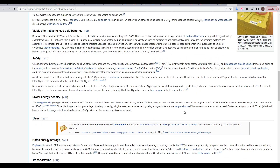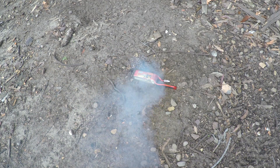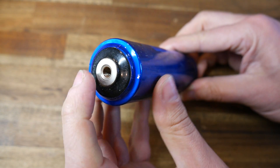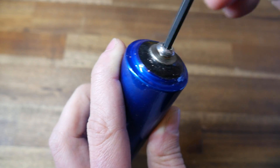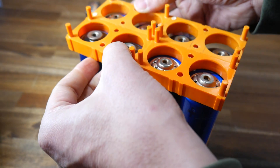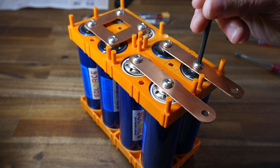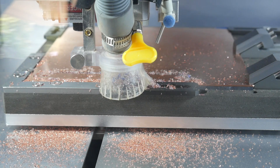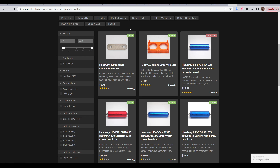Lithium iron phosphate batteries are considered safer than other rechargeable lithium cells, meaning your project is less likely to go up in smoke if something goes wrong. User-friendly — but what really sets them apart are these screw terminals built into each end. They have an M6 thread, which means connecting cells together requires no spot welder for a reliable, strong connection. All you need are some plastic spacers and metal strips with 6-millimeter holes. Off-the-shelf bus bars are inexpensive, or you can buy some metal strap and drill the holes yourself. A user-friendly rechargeable cell — time to turn it into a power bank.